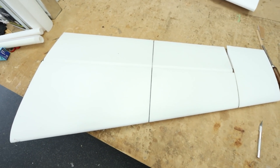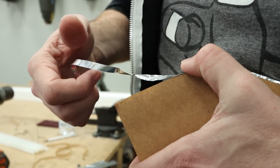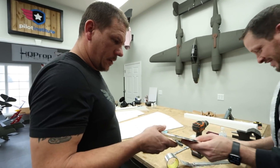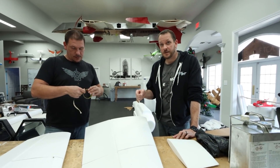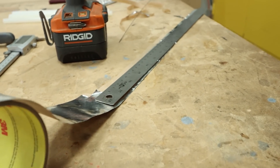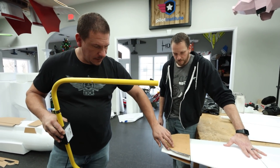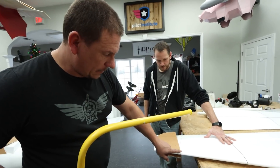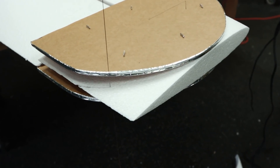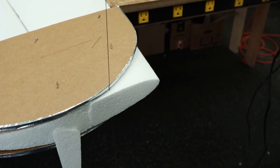I do have the hot wire templates here, and they're going to go right here. We're going to take this aluminum metal tape, trace each end, and then drag the hot wire over it — it's just like a wood template, but smoother and cheaper. This is a technique you'll be able to do on any of your models: cut out a foam template, line it with aluminum tape, and as long as you don't push too hard against the template, it'll work out really well. The important thing is you can't have the aluminum tape from one side touching the other — if you do, it'll create continuity and bypass the part of the wire that needs to be hot.